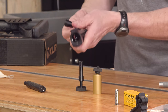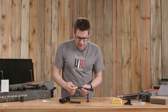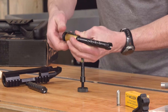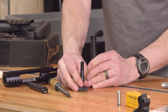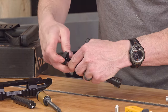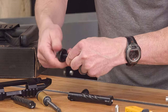We're going to remove the bolt from the action. This one came with a .223 bolt face, which I'm likely to use for another build. We've got the bolt disassembly tool — we're going to put this little pin into the hole in the cocking piece, tighten the knurled nut, and that's going to allow us to very easily rotate the entire firing pin assembly. Now we've got the sleeve removal tool. I'm going to push this in — you hear that little click? That means those little jaws have located themselves behind the sleeve. We're going to tighten that and pull it out. That makes it super easy.